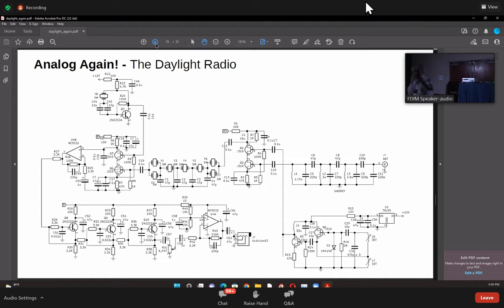Here we don't have that problem, number one. Number two, it's a high impedance output here, which can directly drive the op amp. And these op amps are really superb things. They do not have much distortion, because of the extremely high gain used with this feedback resistor here, right? The feedback actually controls the linearity of the op amp. It's done in a very different way. So they do not overload until you have almost 1 to 2 volts of audio coming into it. Until then, you're perfectly fine, okay? So that's why the dynamic range is very high.